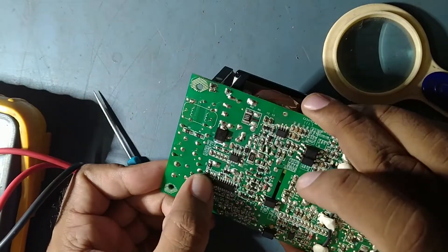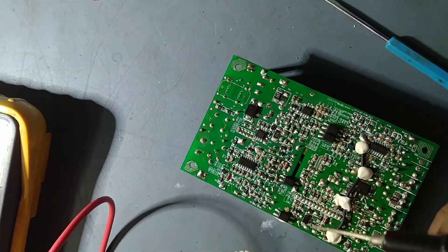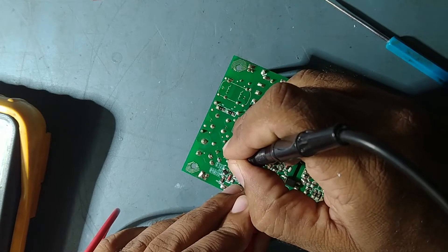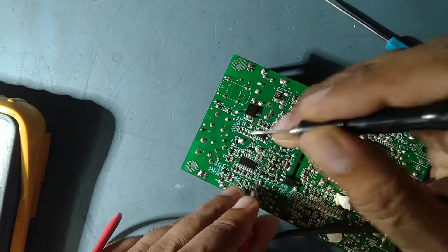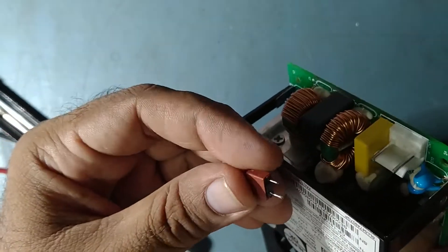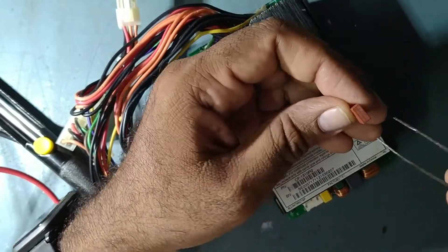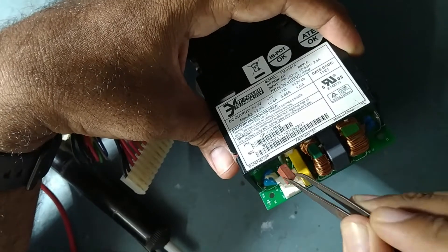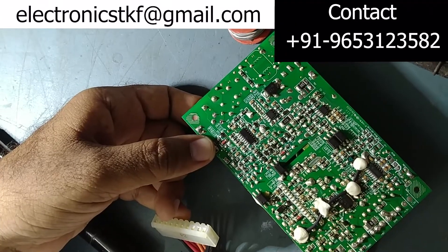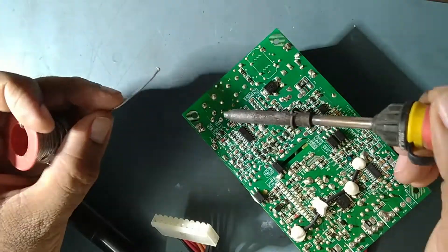I fixed the new PF in place. Now I will put the fuse in also. Be careful while soldering. Now we'll check for any buzzer or shorting with the negative terminal of the main capacitor — only one point is grounded. There is no shorting now. It's okay. Now I will replace the fuse. It's very congested to put the fuse in, so we'll use tweezers to place it.